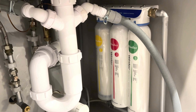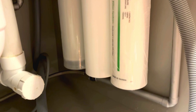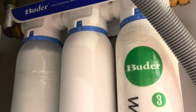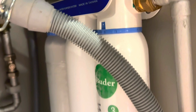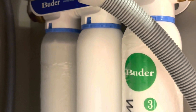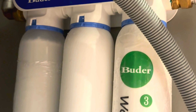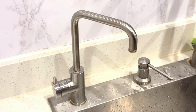Let's turn on the water supply and check the water filter quality. After turning on the water supply, first check whether there is any leakage. My tip is to turn on the water inlet slowly — don't turn it on to full pressure immediately. If any filter is leaking below, carefully remove it and plug it back in. Remember it should fully go in; if water is leaking, the fitting is not done properly, so take it out and fix it again properly till it is not leaking.